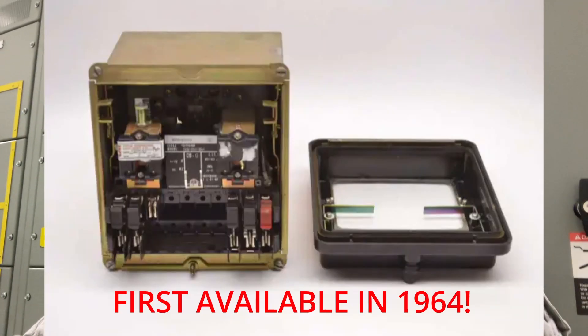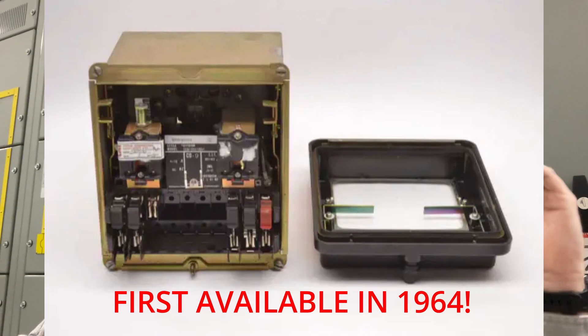Now here's a real weird thing about those. The Flexi-Test style test switch — the ABB cells — they're made by a couple different manufacturers now, but the design dates back to the old Westinghouse CO relays. The old electric mechanicals had them built in. Nowadays you'll find them on panels like this. The goofy thing is, over time they said we need more spots on these test switches, so ABB decided to go with a 14-pole design.